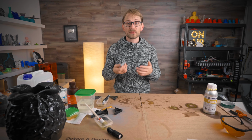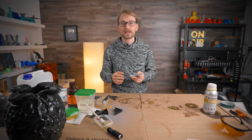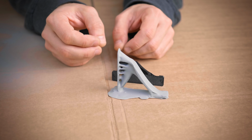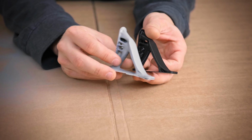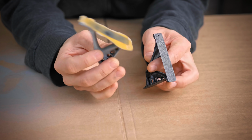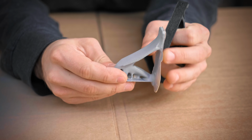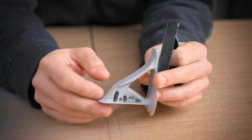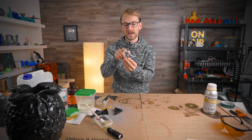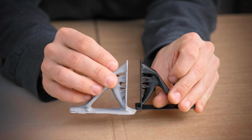So, before I even started with the actual experiment, I did a quick test to see whether it was actually worth making a whole video on resin finishing, and oh boy, did this have promise. There were two small issues with this trial where I just literally dunked the part into the resin vat on the SL1, and that's that there's this massive elephant foot from where the resin piled up on the bottom of my container, and obviously this is neither practical nor pretty, but if you look at the branch structure up here, many of the branches also have fused into one big blob.